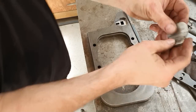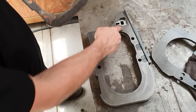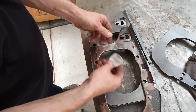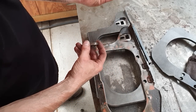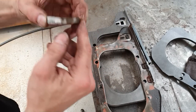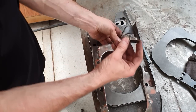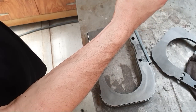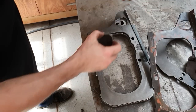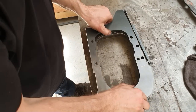Now this little doohickey we've got here, this is to make this piece here. So these are going to be pressed down. This one here is going to be pushed up. So to make that, obviously if I pushed in there against the flat end, it's going to destroy all this. So I've made this small profile piece. It's nothing pretty. It's all just welded and filed up, and that will sit in there and it will sit like that. So it creates this piece, this ramp here. So that sits on top of there. And then we clamp the whole thing together.